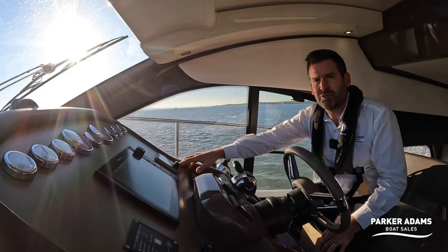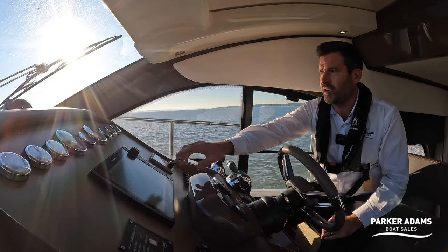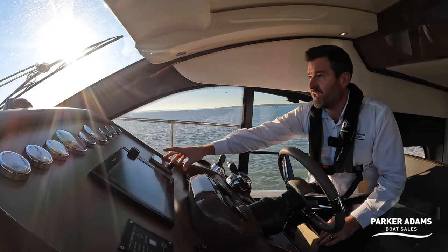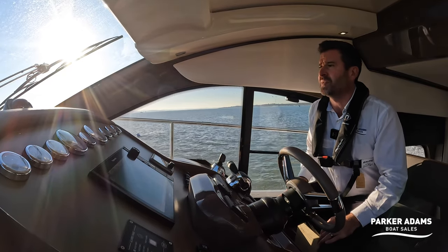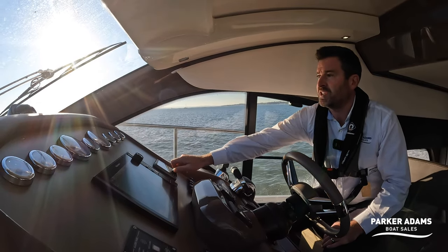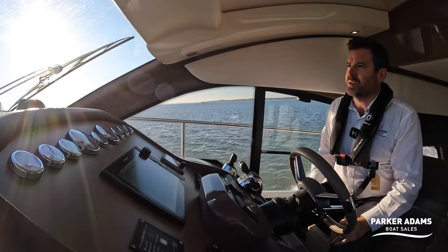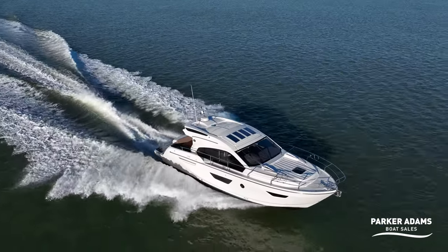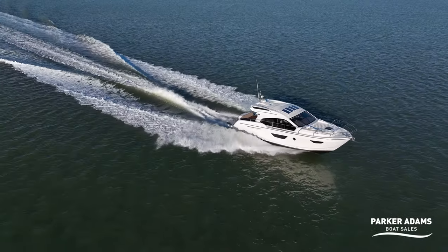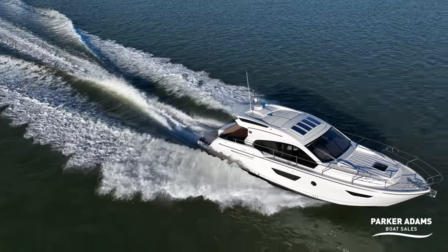It's got a Raymarine autopilot system. As I press auto I can leave the helm alone — it can be controlled off the Raymarine hybrid touch screen or off the autopilot unit itself. You get a choice with the autopilot head: either buttons to change direction, or this one has a toggle which I prefer. If I want to turn to starboard I can just change it very easily — a 15-degree turn to starboard. There are quite a few lobster pots around so I'm keeping a good eye out. I'll do a 20-degree turn to port — responds very well, very quick to change direction but not too quick. Just a nice, reactive feel.